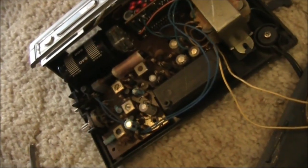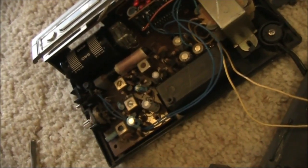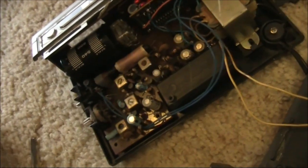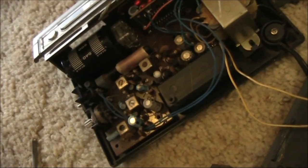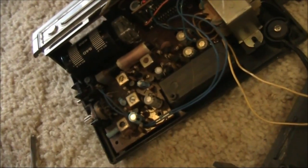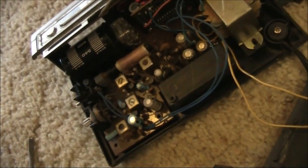In a lot of these very simple circuits, the local oscillator is also done in the same transistor as the mixer - that's called an Autodyne circuit. So the suspect stages are likely to be the detector and the IF amplifiers. Possibly also something wrong with the front end.